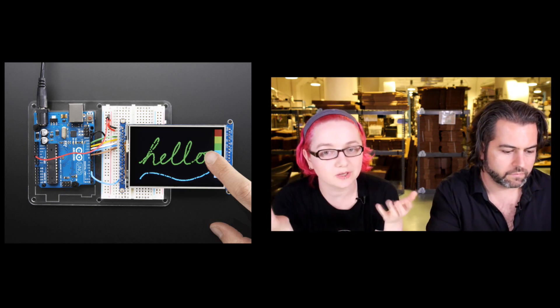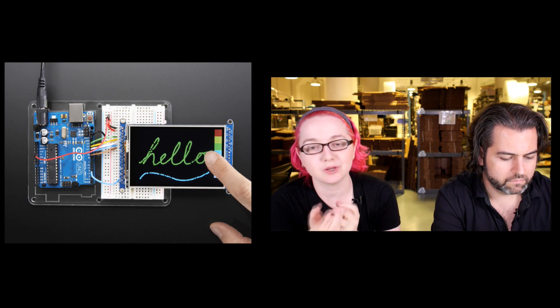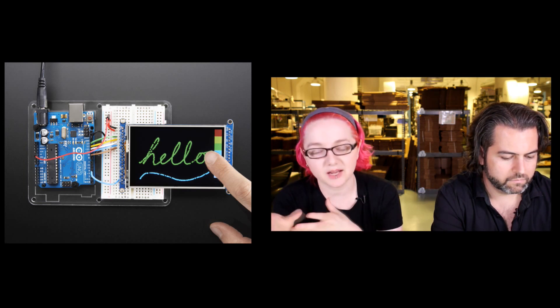This is a screen used in low-cost smartphones. Not the iPhone — that uses a MIPI display — but lower-cost Android devices, like a $50 or $60 phone. Because these screens are now on the market, I can order them at less than $100,000 quantity. For a standard display size and layout you can order at smaller quantities, but a custom screen requires ordering at least $100,000 worth. This one has resistive touch — we're working on getting capacitive touch. I have a sample but I'm still fighting the data sheet to get the capacitive touch to work.